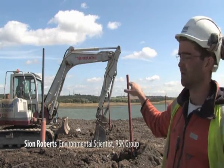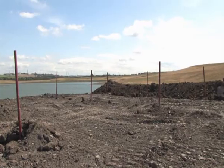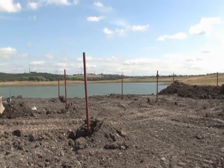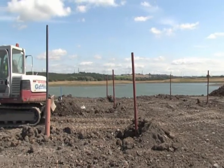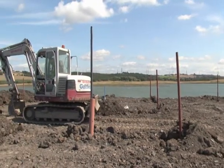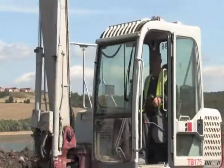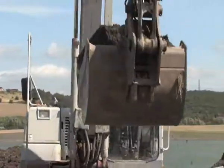We're at the southerly end of Waverley site at the moment, nearest the reservoir. We're conducting a load test which is essentially a six metre high mound of soil that is placed directly upon the backfill of the open cast colliery. The idea is to measure the compression which that stockpile of material, the surcharge, squashes and compresses the existing backfill material.